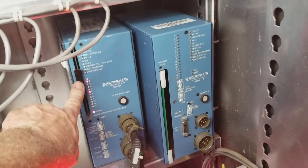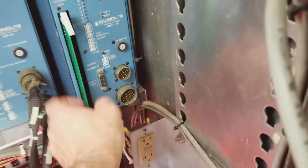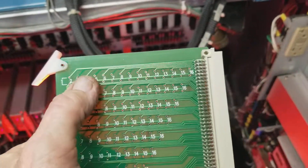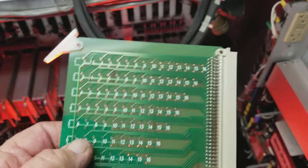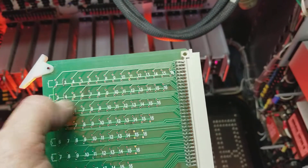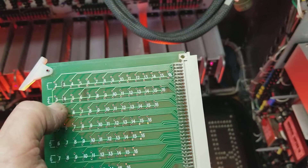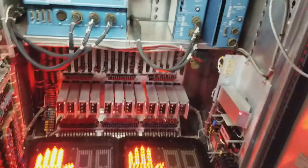I had a heck of a time with that. There's a program card in here, and one of the things is there are a bunch of jumpers that need to be set — these are the jumpers that need to work together. I was under the false impression that these were the ones that couldn't work together, but I had three and four jumped off from one and three, and two and four. Those actually are ones that it would work together with, not ones I didn't want working together.